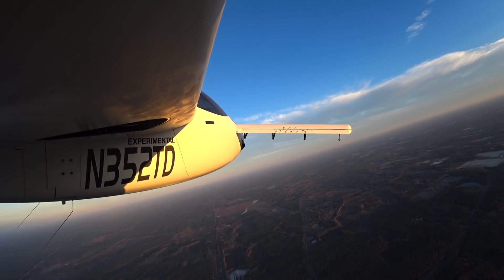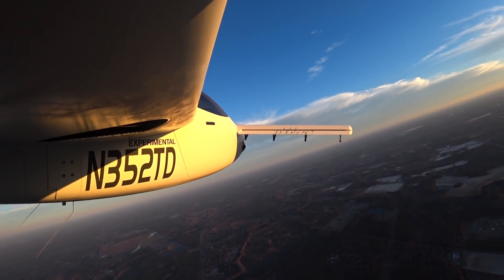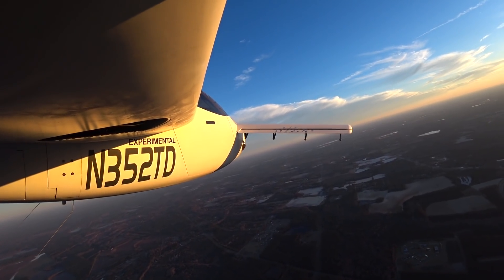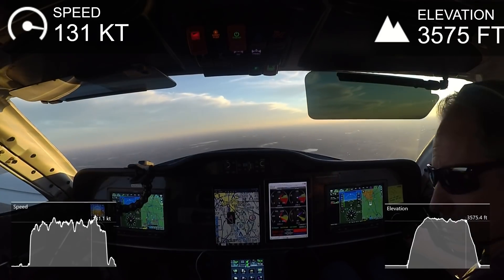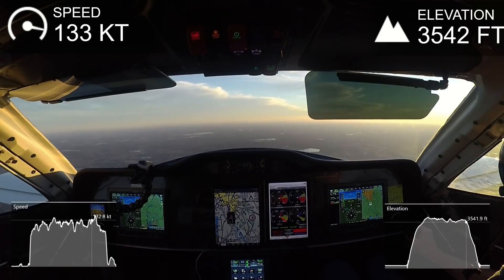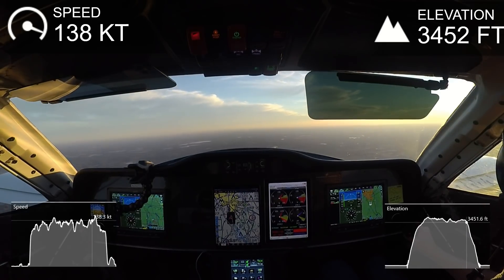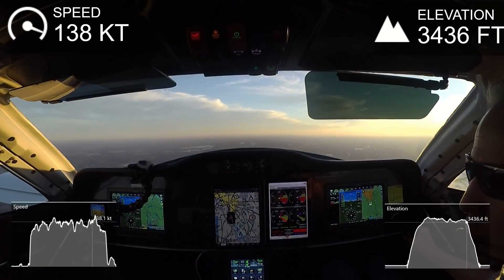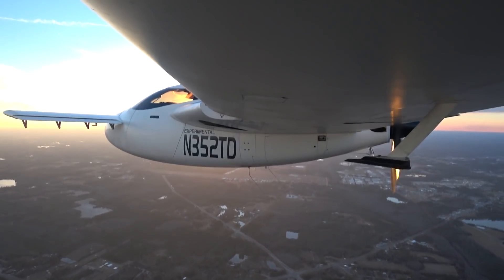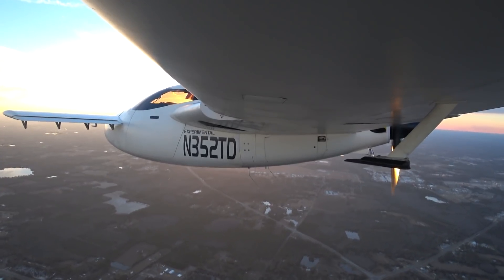I tried to find that seal in Viton material but they don't make it in Viton, and the one I have is already the highest-temp one available — a 300-degree seal — so it should be okay. I think what happened is the seal in there is just worn because for a while it was still in there when I wasn't running it with the full oil bath in the redrive. I've ordered a new one arriving in the next couple of days, then I'll pull the redrive out, pull the prop off, press out the old seal and put the new one in. After that all the seals will have been changed — it's just a tiny bit of oil leaking but it won't get better over time, so I need to change it now.